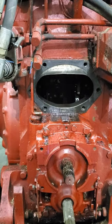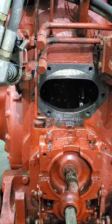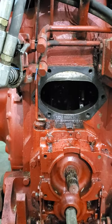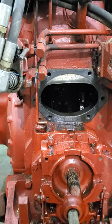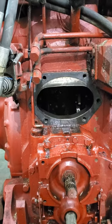I'm going to go through a couple positions here. The first one, we will take the draft position lever all the way forward. That way, it'll be dumping oil to where the lift would lower really slow. Then I'm going to raise it, and then I'm going to lower the loader, and you'll see the relief valve come in.